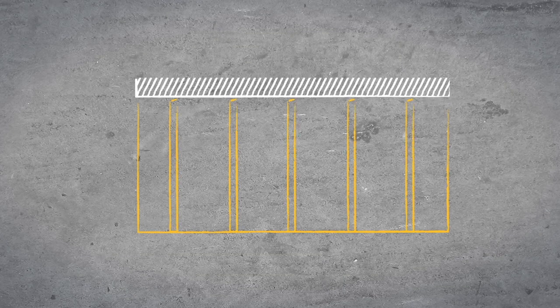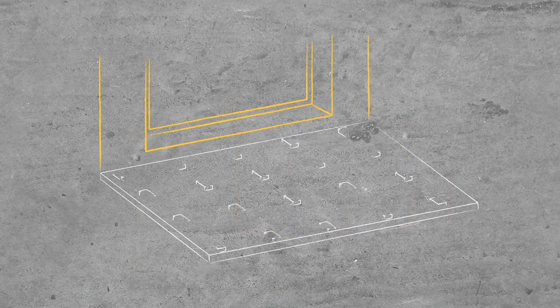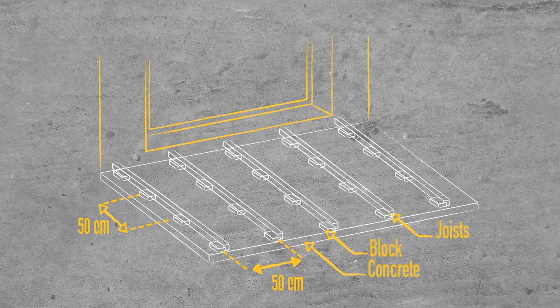It is best to place the decking strips perpendicular to the direction of walking. Using buffers under the frame will help to keep water flowing freely and avoid all contact with the soil. The slats are then laid crossways. Maintain a gap of 40 to 50 centimeters between the joists, depending on the thickness or the composition of the slats.